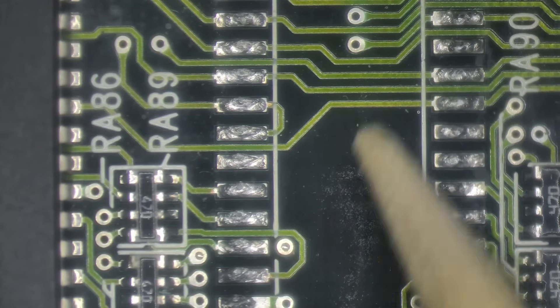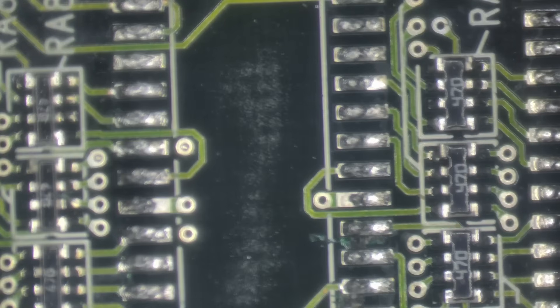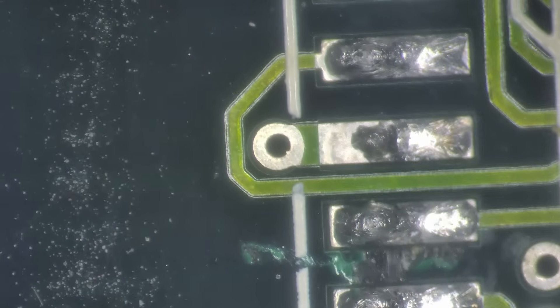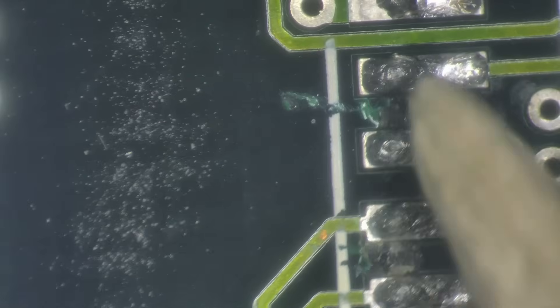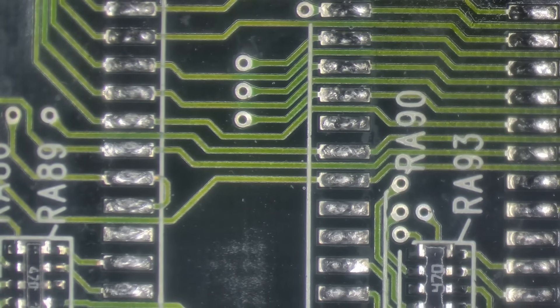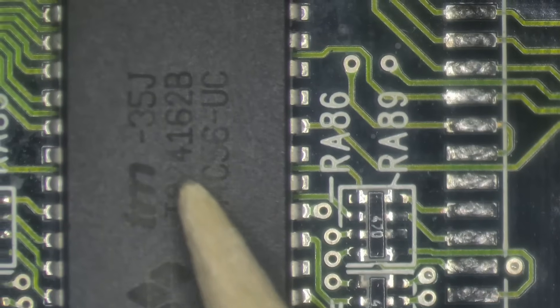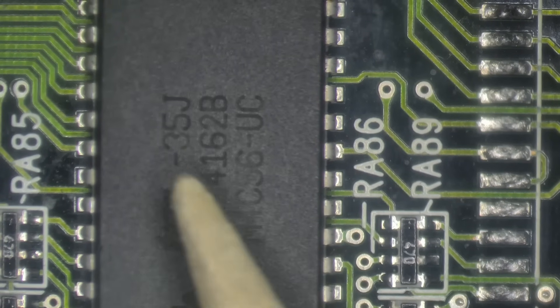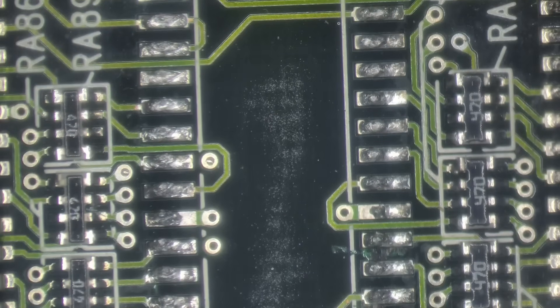So now what we have to do is replace these two chips. The first location I removed was where the chip got hot, but it was not our bad chip. I also see there's some damage to the solder mask here, but otherwise it looks okay. I need to remove the solder and add new memory chips. Unfortunately I don't have the same model, so these two will have a different manufacturer. This one is 35 nanoseconds - I think I do have 35 nanosecond chips to keep at least the speed the same. Let's clean up first.